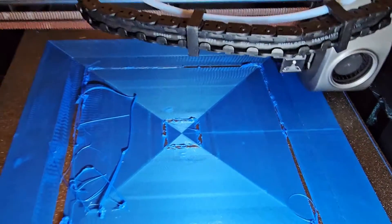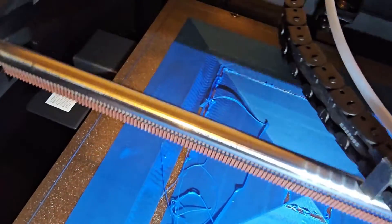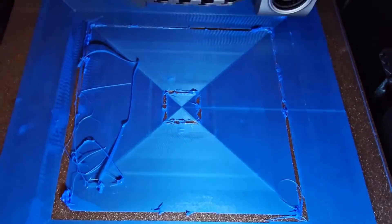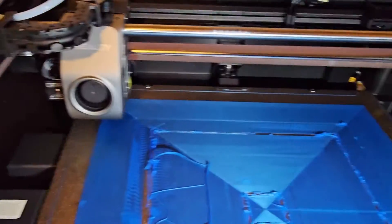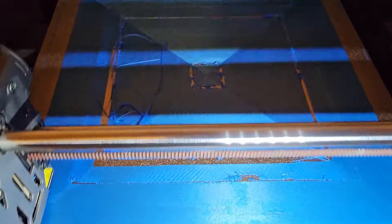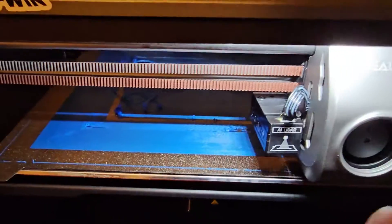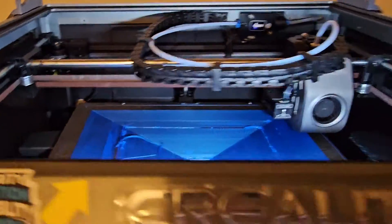Let me set velocity to 100 and see what happens. I can definitely hear a different sound now. But it still prints really nicely on every corner — no more ringing because there's no more vibration. One part starts to dip though — how is that possible? And this section is wider and way more blue. Is it because it's moving in different directions making a different color? 3D printing is so cool but so weird. Let me change acceleration back to 150 and see if ringing starts to appear again.